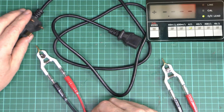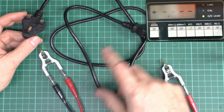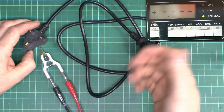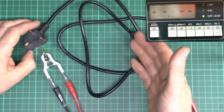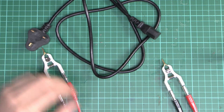If you connected this to any kind of even a small load, you're basically putting over 2 ohms of resistance in series with that load. High resistance in series means you're going to get a significant voltage drop, and most importantly, a whole load of heat wasted away in the cable — which is going to result in this thing getting exceptionally hot, melting, or even setting on fire.